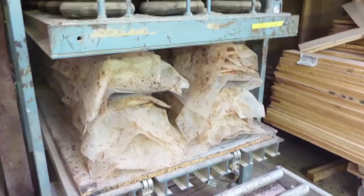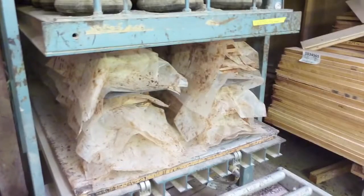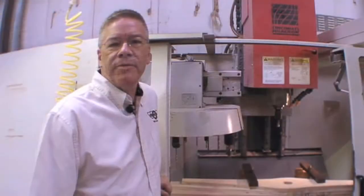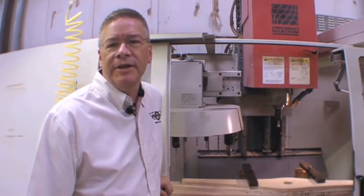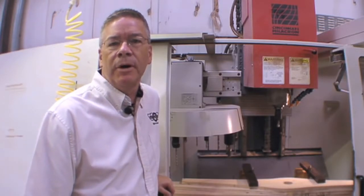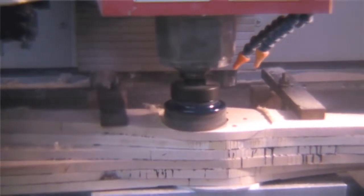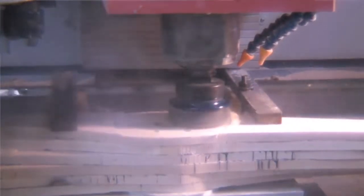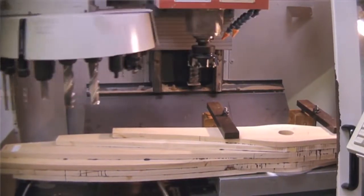After a seven to ten day cure, the blanks are sent off to the CNC area for CNC machining. We bring the blank over to mill the hub base and bore the bolt holes and the center bore. That's done in a CNC vertical mill using a variety of tools — drills, mills, and chamfer tools.